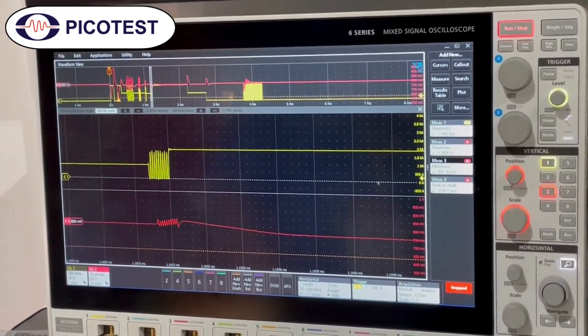How do you measure 2,000 amps on the oscilloscope? What we're actually looking at isn't the current signal — it's the current programming signal. We test individual cells using DC measurement, but at high speed there isn't a current probe that can measure 1,000 amps per nanosecond with more than 350 MHz bandwidth. Also, the current flows from every side of the board, so there's no single point containing all 2,000 amps. The yellow trace is actually a measure of the current programming signal — the control voltage. To actually measure the current, one method is near-field extraction: we measure the near-field in the load cell and integrate that in the scope.